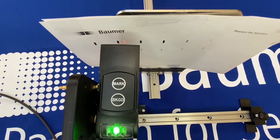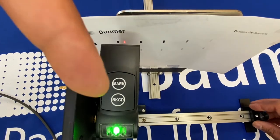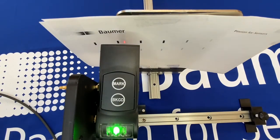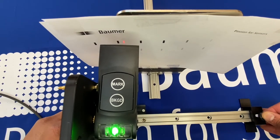When the green ready/go LED — the middle one — turns on and stays steady, your setup is ready to go. You'll see that the beam spot has actually changed color. The sensor automatically detects, from the red, green, and blue array it sends out, which is the best light combination to pick up on the registration mark stably. The first LED gives the output, the middle LED gives ready/go status, and the last LED indicates whether the optional 20 millisecond delay has been activated.